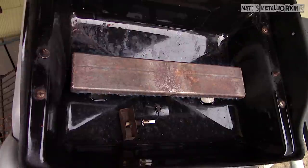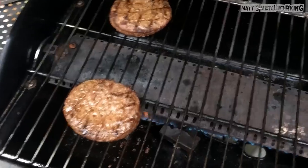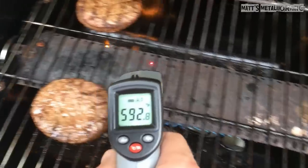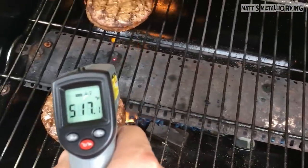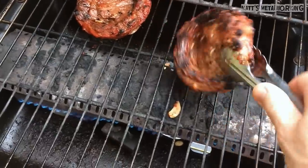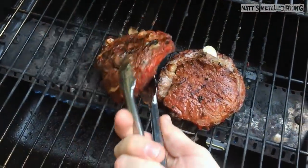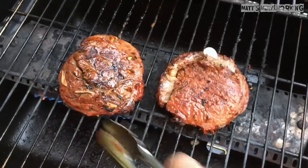Keep in mind this is my very first barbecue burner I have ever made so it's certainly been a learning experience. The update as to how it cooks food — I couldn't be more happy with it. I have found if I keep the lid closed it does maintain a fixed temperature much better than before. As a wrap-up of what I've learned: smaller holes will definitely give you a finer flame. The thicker steel holds the heat extremely well and despite having fewer holes the heat output seems to be much better.